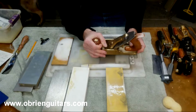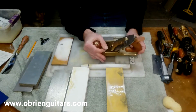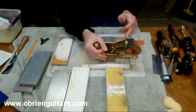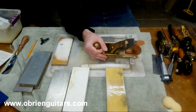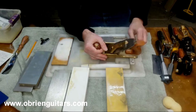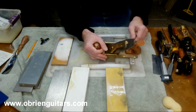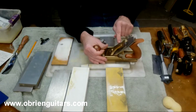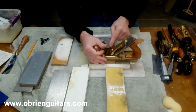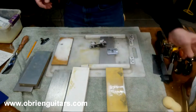That's a little bit beyond the scope of what I wanted to go into here in the sharpening class, the angle that the blade attacks the wood. For your end grain, for example, you would like a higher set to your angle. And you can do that through the way that the plane is set, or whether the iron is set onto the frog of the plane, or you can re-hone your angle to adjust. A good example of that, let me grab something off camera here and I'll show you.